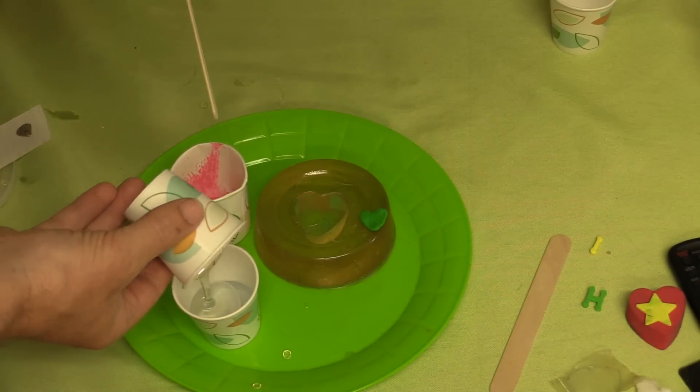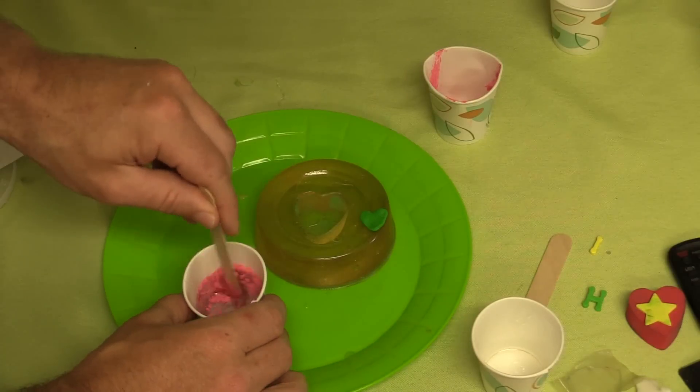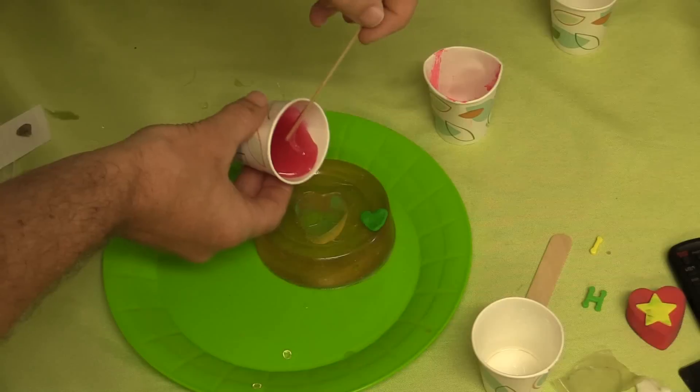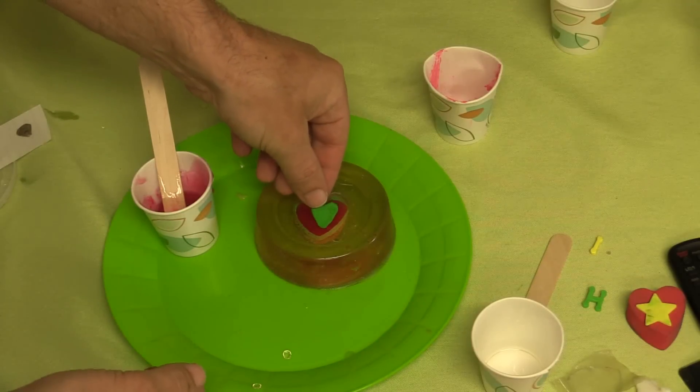We will cast with clear casting plastic. To make the color-changing properties, we'll be adding a thermochromatic ink into the clear casting plastic to make our casting. Be sure to break up the particles of the thermochromatic ink when it's in the clear casting plastic by mixing it thoroughly.